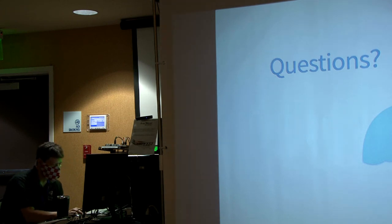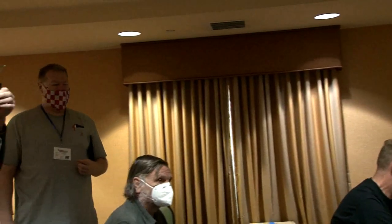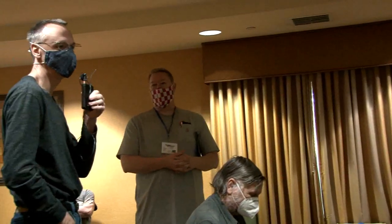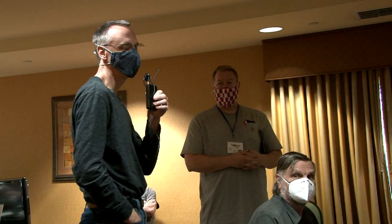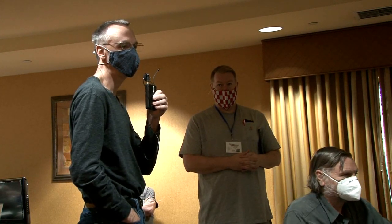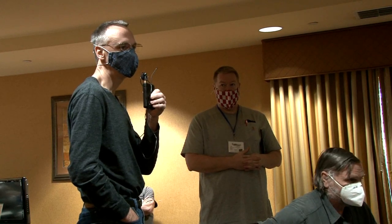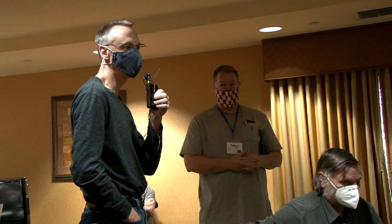Thank you. Any other questions? Hi. First, I'd like to say I love this project. I think it's an awesome thing that you're doing for the 68K and the Amiga community. A quick question regarding the memory map. I think I saw the ARM peripheral addresses were down in the 32-bit space. I imagine that's so that you can create drivers inside of Amiga OS that communicate with ARM peripherals. Are there any challenges with those addresses overlapping other Amiga reserved addresses?